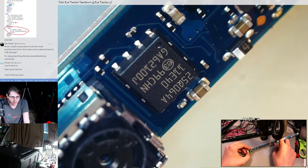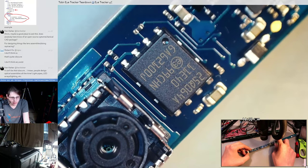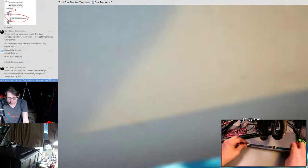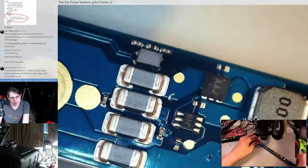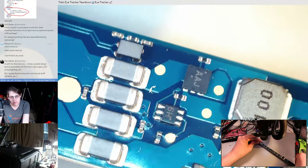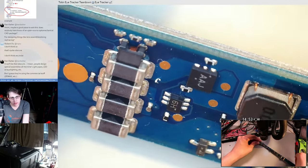Yeah, I think I might plug it into USB next and see what it looks like over USB, but it could be really interesting to take a look at that flash chip and just spy on the bus and see what it's doing. Can we follow USB or did we lose track of that? Looks like it goes down into internal layers right where we hit this ferrite bead. This board is definitely still using via in pad. So that's just going to go straight down and then across.